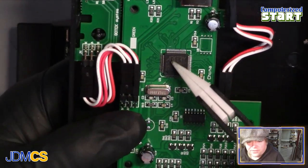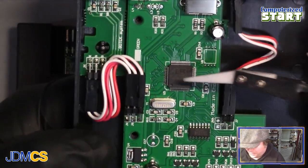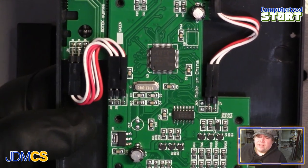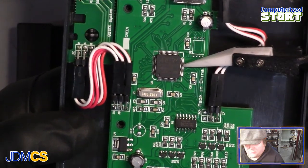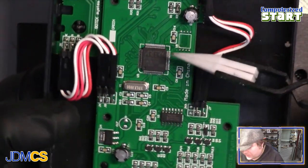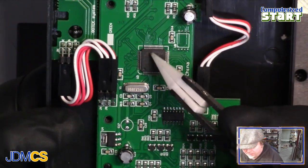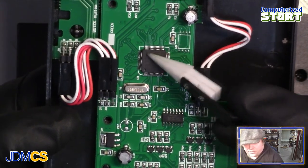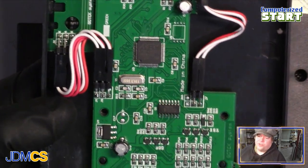Now, there is another version of the 415s that actually use a smaller footprint microcontroller. So if you would actually have the board open and you see like a really tiny microcontroller, the pins are basically, I forget what the package style is. It's another package style that I can't remember the name of right offhand. If you've looked at a Raspberry Pi Pico and looked at the microcontroller, it seems to have like really small legs. The other Artery 435 style that has fewer pins looks like that. So if you see one of the little microcontrollers, you have a 415.